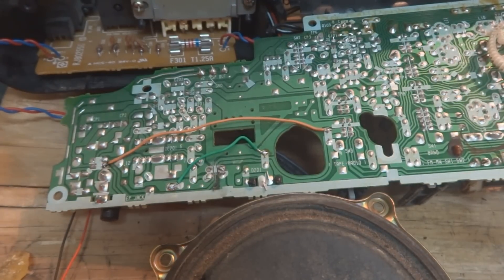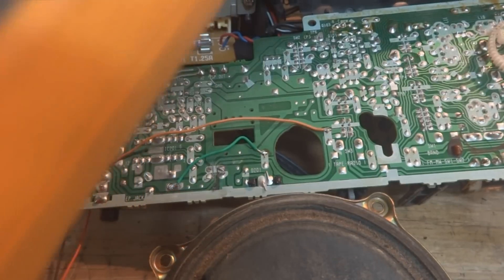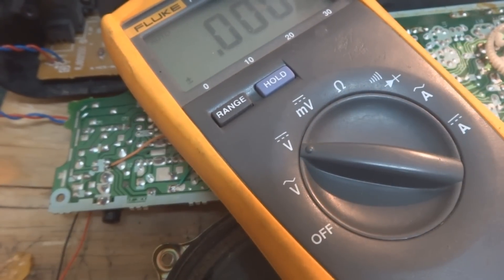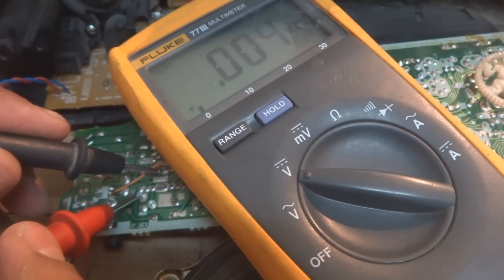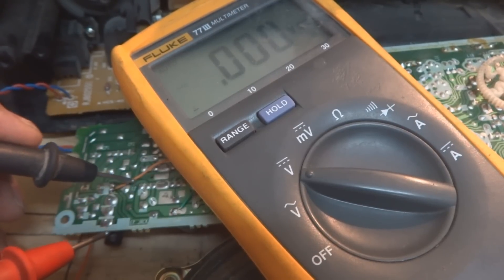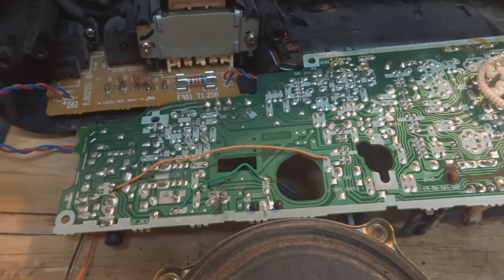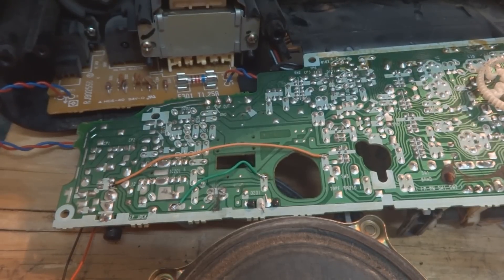This mono had been come to life. So what we have to do is I have to check the voltage if it is possible on pin number 12 of this IC. Just giving you some demonstration — yeah, up to some extent it is possible so that you will have an idea that now the voltage had been restored. So on pin number 12 I'm checking 5.2 volt. You can get on this IC pin number 12. So this was what was our repair on this radio and cassette player. Hope you enjoyed this video, as only the two pieces of wire I had restored this thing to life. Once again if you enjoyed this video please thumbs up, like, subscribe and share with your friends. Thank you for watching.